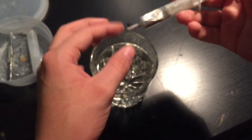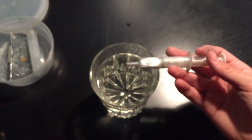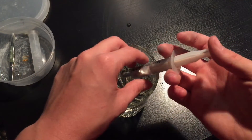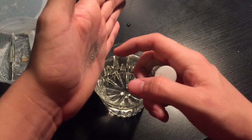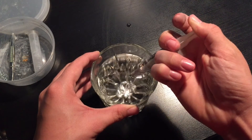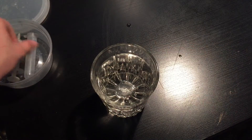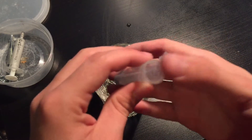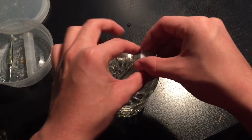You can mold it into things — I just don't have a mold available right now. You can always use wax; I used wax to get it into the shape it was when I brought it out for you all to see. As long as you keep it in the hot water it'll stay melted, but it originally came in this little vial. It is corrosive to aluminum — it'll alloy with aluminum and make it very brittle.